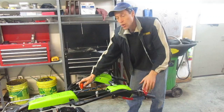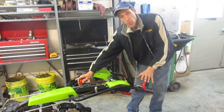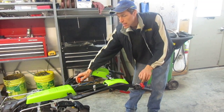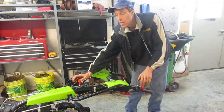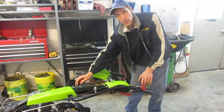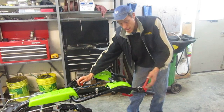No fuss. No excessive force is necessary — just some finesse. Finesse, not force. If you pull too hard or push too hard on the PTO engagement lever to try to force it into place, you're going to end up damaging your PTO shift linkage. You've got a lot of leverage on this lever and a lot of strength, and we have seen it happen on all makes and models of tractors.